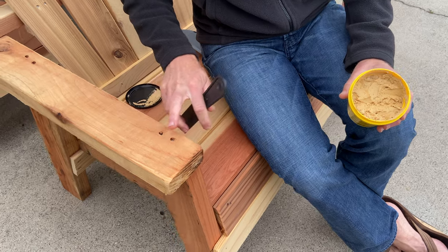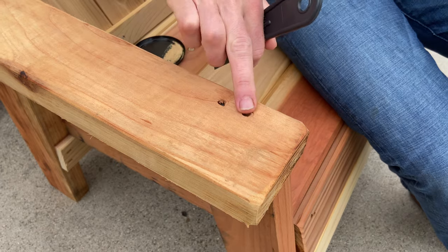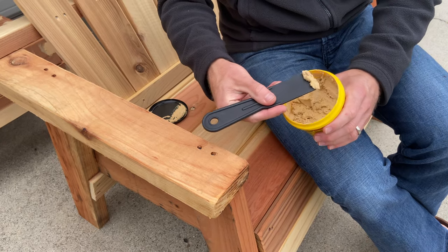You're also going to need to apply it with standard spackle or putty knives that you can get cheaply. They make really nice metal ones, but for this the plastic will work just fine since you're not doing fine woodworking. These are the only two materials you really need. Now we're going to go ahead and move on to applying the wood filler. Here we have some deep nail holes in the arm of the Adirondack bench, and what we're going to do is try to fill these entirely all the way to the top with wood filler.